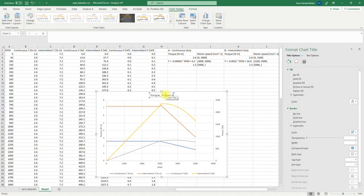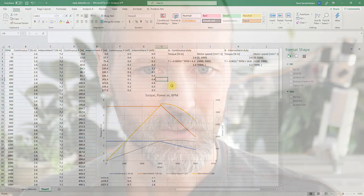So why upgrade the BLDC motor? I wanted better performance especially at low speeds for tapping and drilling. The speed of the BLDC sags under load and overruns when clear, and neither are ideal for maintaining a constant chip load. I also wanted diagnostics including speed and torque, higher speeds without compromising torque, and more reliable detection of a spindle fault. The original BLDC drive has a fault indicator LED but it lights too long after the actual fault occurs to be useful.